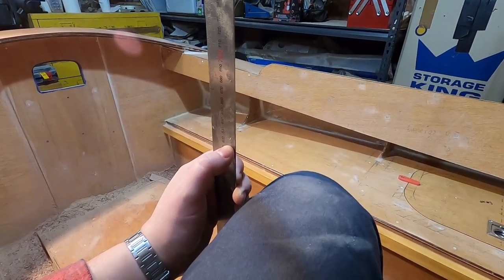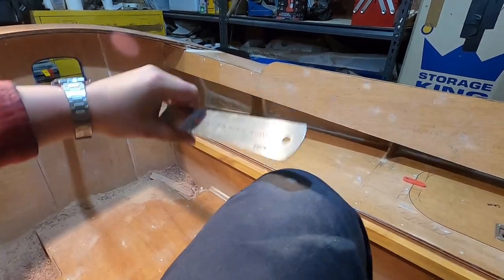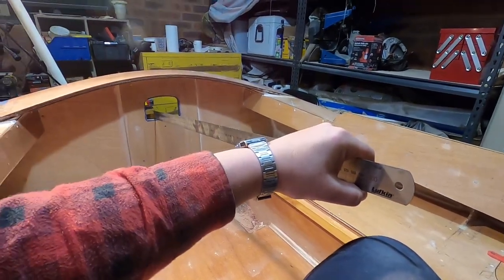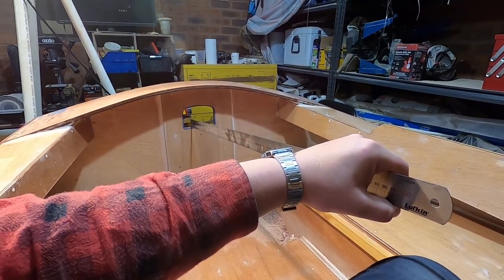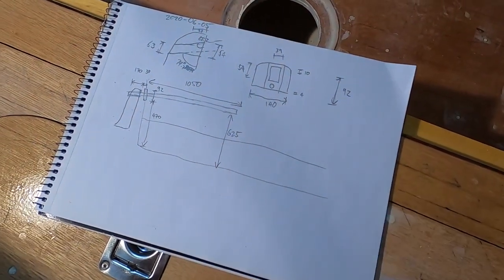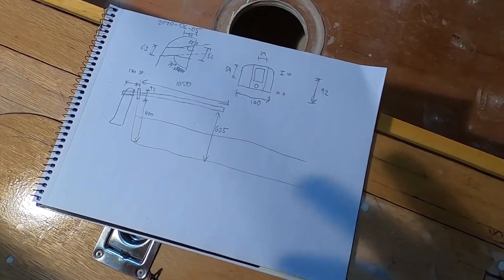It's about 620 millimeters above the sole here. As for length, that's a meter from the tiller hole, so it'll have to be a bit longer than that. I've taken a bunch of measurements, and I'll draw something up in SOLIDWORKS. I think I'm going to construct it by cutting a bunch of strips and making a template, then laminating them all together in a nice curve.